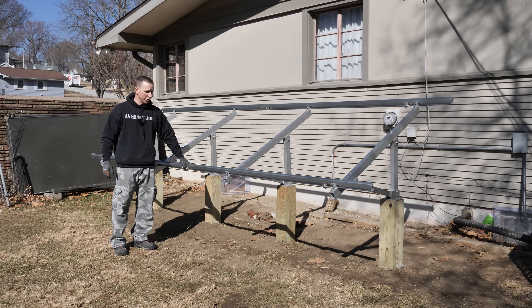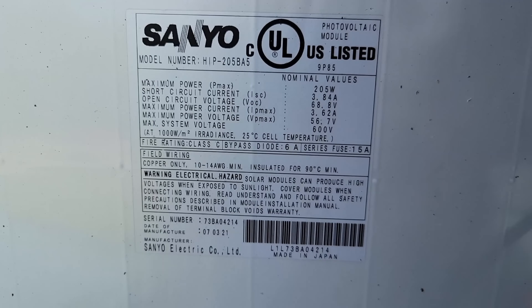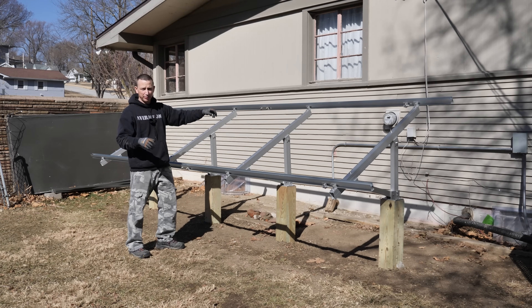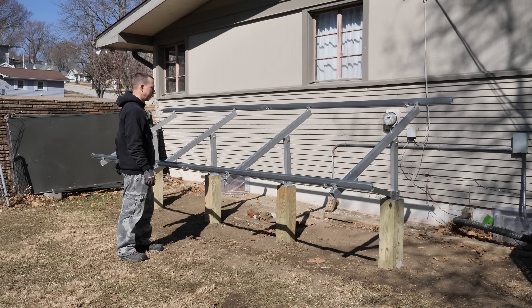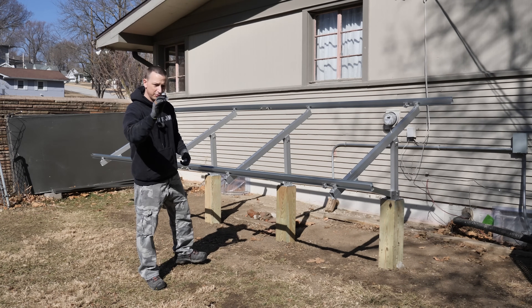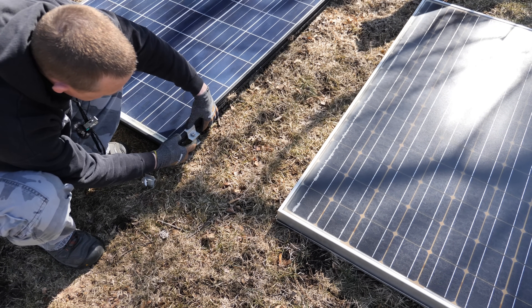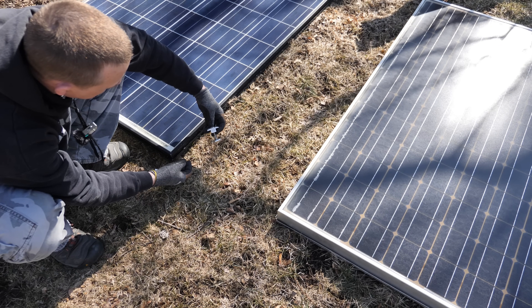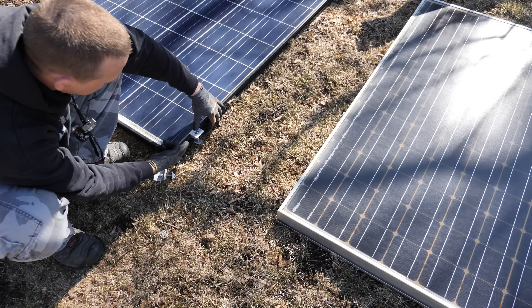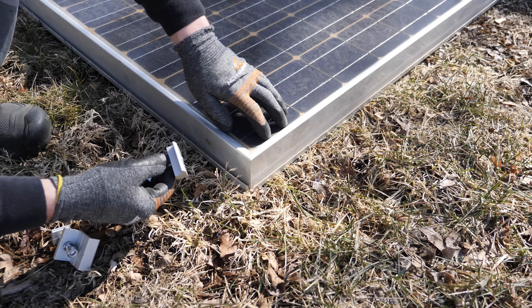I'm really impressed and excited to get some panels on here. The panels I'm going to be using are Sanyo 205-watt panels with an odd shape, and I can actually fit five on here with those. If you're using regular size panels you'll put four on here. With regular panels it's easy - for the end clamp you set it on there and tighten your bolt down, making sure the clamp length is close to the same size as your panel. The mid clamp clamps down two different panels at the same time.